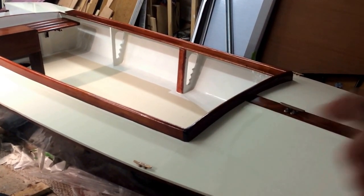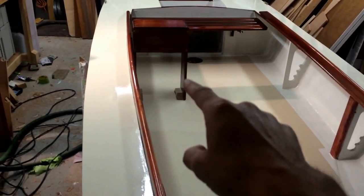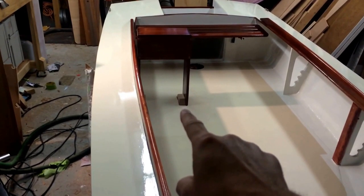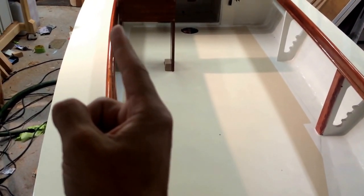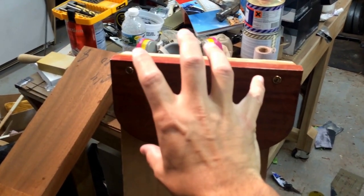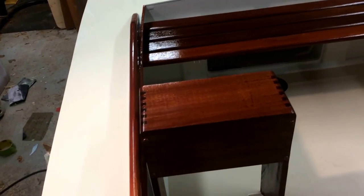I've created some little cutouts in the knees — the bulkheads — on this side for rod and oar storage. The console here is also made of mahogany, finger-joined on the top edges. There are some blocks attached with thickened epoxy to the sole, and the console sits down over top. Screws will go through the feet or legs of the console to secure it to the floor, along with another block to be attached up underneath. I'll also be attaching a plate which the engine controls will mount to, and that plate will be secured between the benches and the console up under the combing.